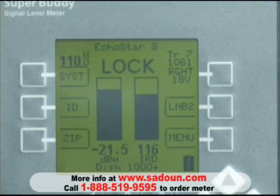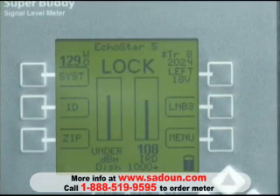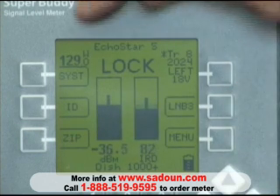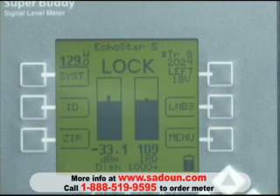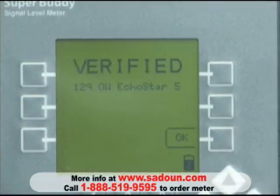Back in the normal run screen, we're going to disconnect our cable from the 110 LNB and reconnect it to the 129 LNB. After doing so, we'll push our LNB power to select LNB3, which is tied to the 129 orbital slot. Like the 110, it's basically a verification because we were careful when we aligned the 119. We're able to see a signal level of minus 33 dBm and a good signal quality value of around 108. To verify we are receiving the 129 satellite signal, we push our ID soft key, and it verifies that, in fact, we are.